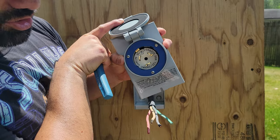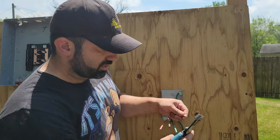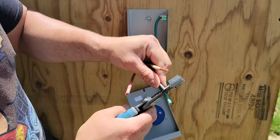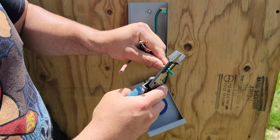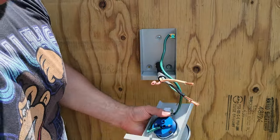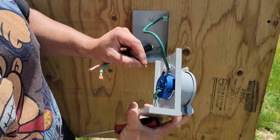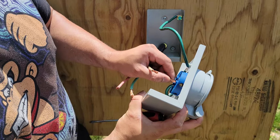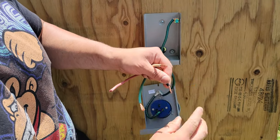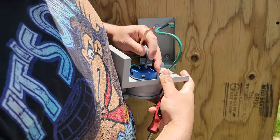Let's connect it. We're going to strip this back — this is a 10 gauge wire. I'm going to pick the black. You just want to go just a hair in there and strip those three back. The other wire we're just going to leave as extra. Let's pick Y — it's irrelevant which one you pick as long as you pick the same on both sides. You unscrew it, stick it in there, make sure all the little copper wires go inside, and then tighten it up.